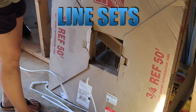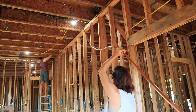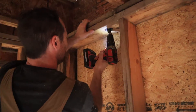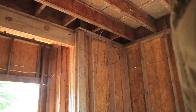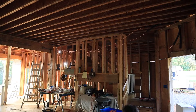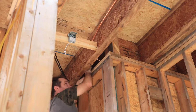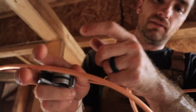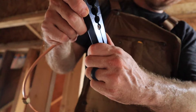Line sets are probably the hardest part of the whole installation, especially because we chose to run our own copper, foam tape, all that. They do make pre-charged units that are already wrapped — you just fish them through — but I didn't like that you can't do a custom length. You're stuck with whatever length you buy and can't cut and redo it because it's pre-filled with refrigerant. We chose to run our own line sets so we didn't end up with too much or too little. You really have to pay attention to the numbers depending on your lengths, units, and the required diameter of copper pipe.